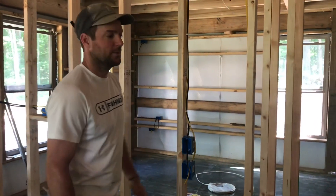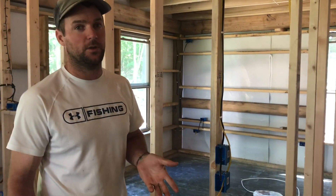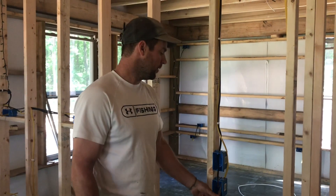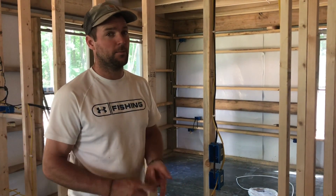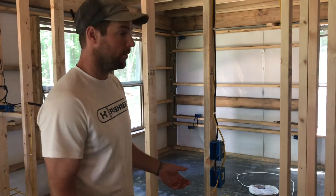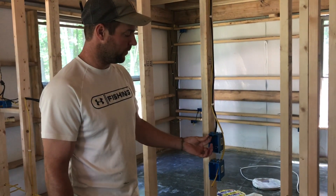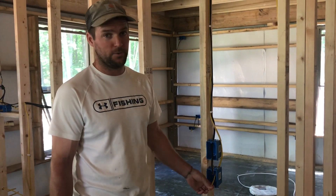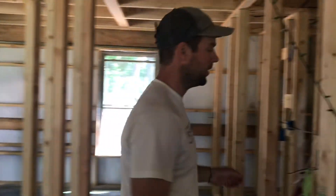Tell us about the wiring. Okay, so what we've done is we wired it just like you would with Romex. Then we came back and rewired all the lighting and the stuff we're going to use so we can run low voltage, because it's more efficient for what we're doing. This is for the refrigerator — we'll run a 24-volt refrigerator most likely, but we've already got it wired in case we want to run a regular 110 refrigerator. It's already wired.